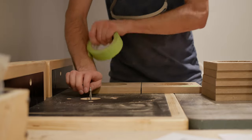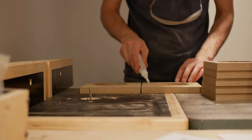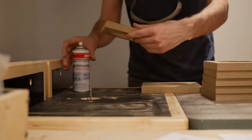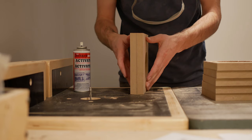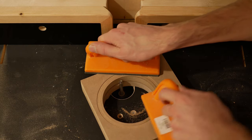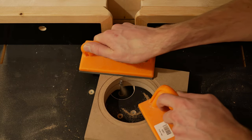As someone who's used to using a lot of double-sided tape, I was a little reluctant to do the whole painters tape and super glue trick. It seemed like a whole lot of extra work, but it actually has a really firm hold on the workpiece and it's a little bit easier to clean up than the double-sided tape I was using before. I used the first side as a template to duplicate the exact opening with a bearing-guided router bit.